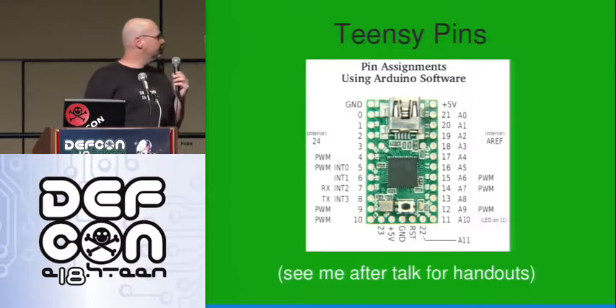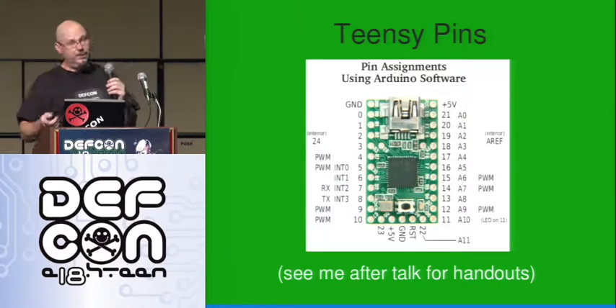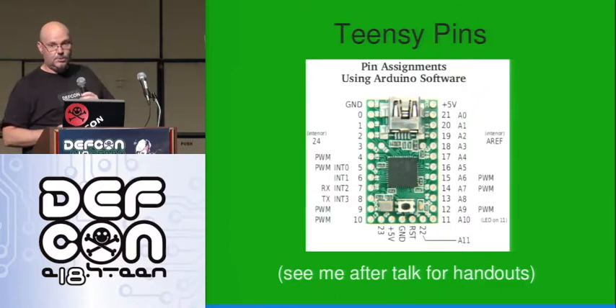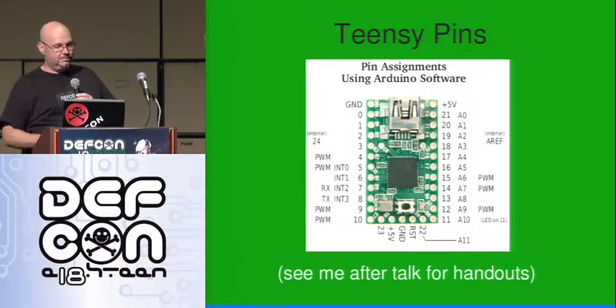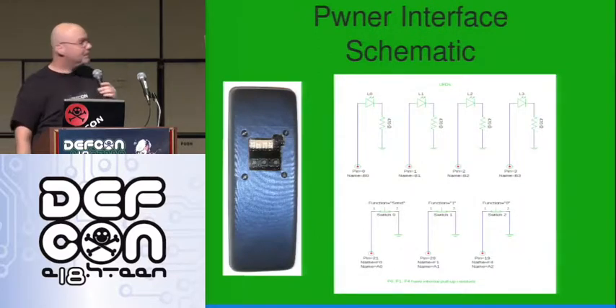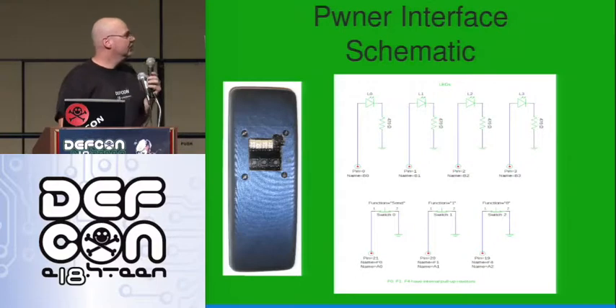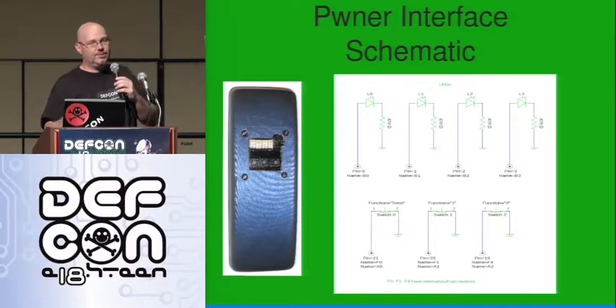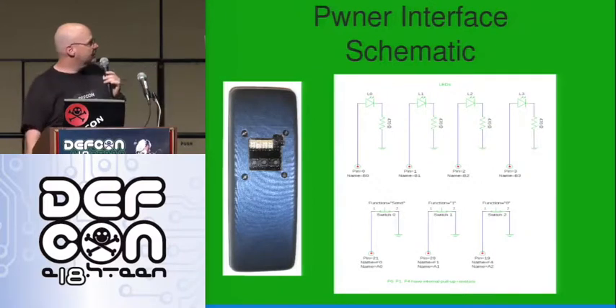Thanks to Paul, the guy who built it. I love the Arduino and the Teensy — they're great devices to work on. And if you haven't done stuff like this, I think this is a great little device to start with. I've played with lots of microcontrollers a little off and on over the years, and I like this one a lot. There's a schematic for the interface: four lights, three switches. For the switches you usually need pull-up resistors, but those are built in — you can turn them on on those data lines, so you don't need external ones. Pretty easy to do.